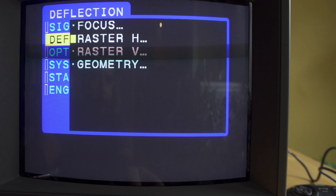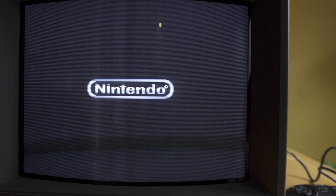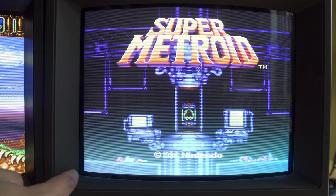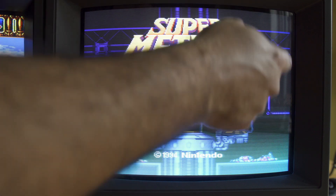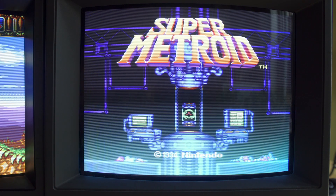You'll see we have all these different adjustments on the L2 model as well. It's a newer model, so the menu looks a bit nicer and gives you a little more detail about what you're adjusting. What we're basically adjusting here is just the horizontal blank left, so we're able to fill the image. Then we turn the game back on and you'll see that all four corners have a really nice strong image — the game is perfectly centered and everything looks as we'd expect.